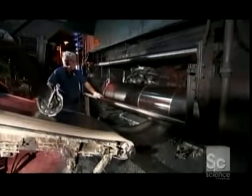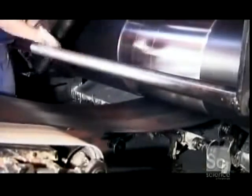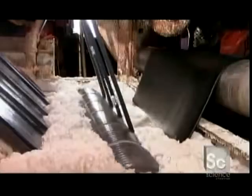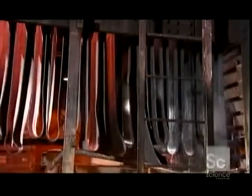Once the rubber has been sufficiently processed, they feed it to a conveyor. A wheel rolls over the rubber to impress the date and identification number onto it. The rubber then winds through a tank of soapy water. As it exits, it falls over hangers that move it through a dryer. A soapy residue remains, keeping the layers from sticking together as they await more processing.